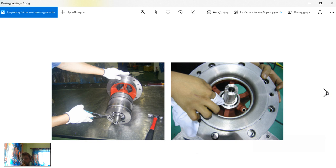You must be careful how you insert the snap ring, because there is a special groove and it must be equally inserted inside. All the snap ring must be properly seated. To test this, using snap ring pliers you can turn your snap ring — it must turn easily inside or must be intact. This is really important.